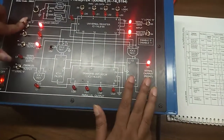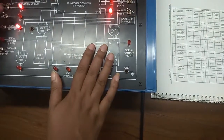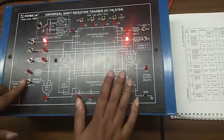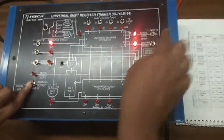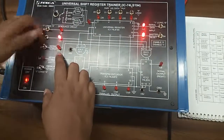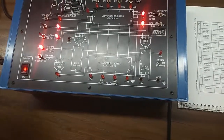We will see the fourth one, that is serial right in and serial left out. First reset the master switch and then put it in disable mode. For input, we need to put S0 at 1 and S1 at 0. Serial output will be in disable mode, parallel output will be in disable mode. Now we will give the serial data input. To see the output, we will put S0 at 0 and S1 at 1, serial output at enable mode, and now we will see the output. Here we can see the output.